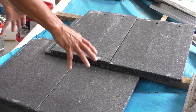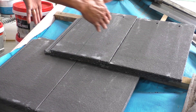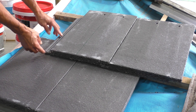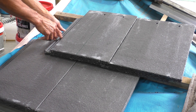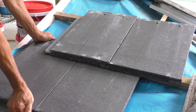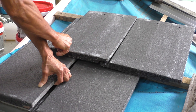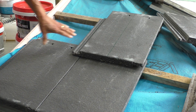There's a reason why for this particular tile the recommendation is to lay it on a cross pattern. The main reason is you've got full support for the weak water course here. If you stand on this tile and there's a bit of a wobble, the tile moves up and down, you've still got fairly good support for this tile.